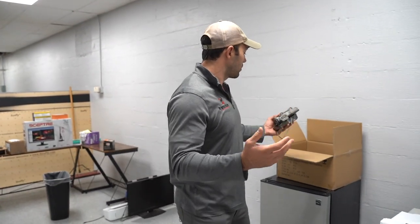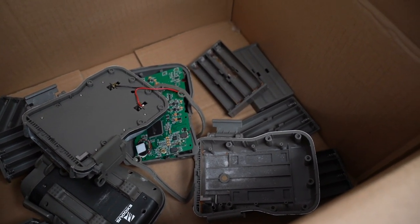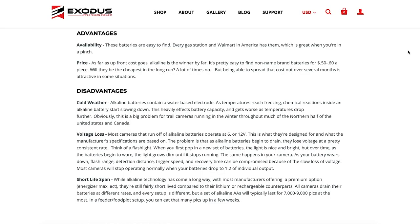Alkaline batteries — you can use them, we're not saying you can't — but you have to be aware of the issues they cause. It's just so much easier to use lithium batteries. There's no voltage drop; lithium batteries have a constant discharge rate versus alkaline batteries, which discharge basically straight down. You only get half the capacity because once you get under one volt or 1.2 volts, you won't have enough power to properly operate the camera. The real challenge with alkalines is the internal resistance changing, which causes problems such as leaking, exploding, or self-discharging.